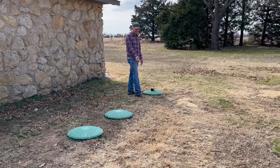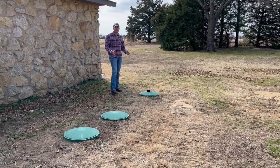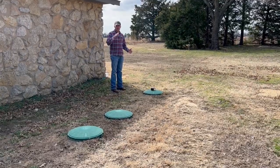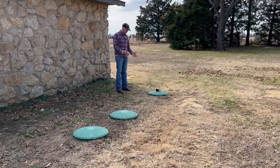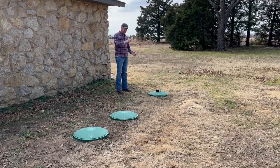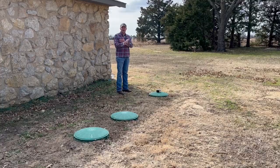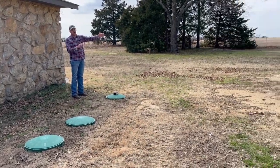The spray tank is also where you put bleach or chlorine tablets. Mine has a chlorine container right under the lid; others have it beside the tank. You either put in liquid bleach or chlorine tablets — it's that simple. Once it gets used every day, the bottom float engages as it floats up when you take showers and flush the toilet, working its way through the system.